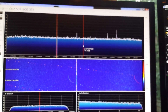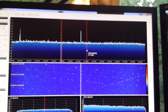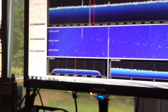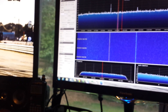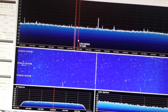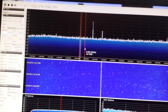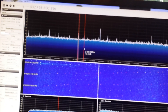Anyway, I just got my HackRF One last week and got it running a couple days ago. It's a pretty cool little toy — it's got a huge wide frequency range. A lot of people are talking about the performance way down in the HF, and I've actually found it's pretty decent. There are a few images, but if you can handle that, it's not that bad. If you crank the gain up a little bit, it can be sensitive enough to get some good signals out of it.